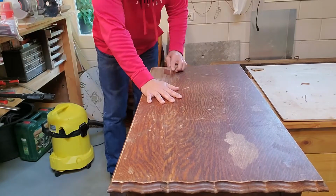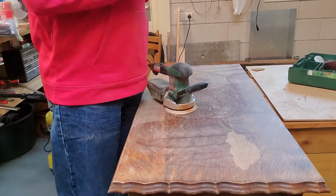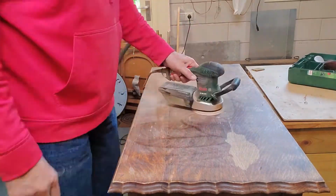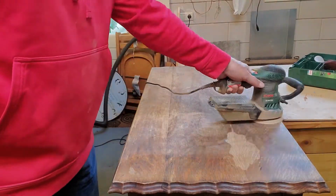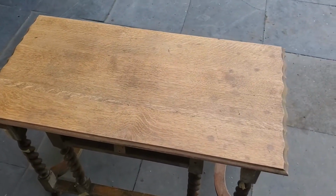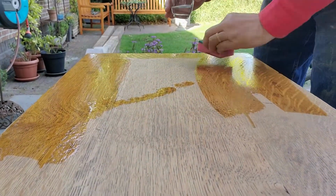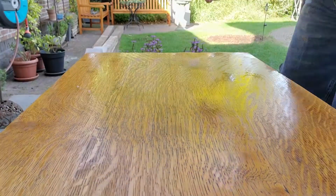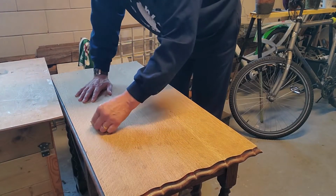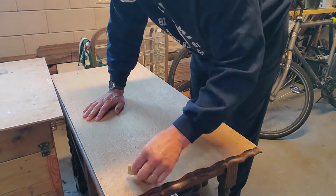The top was really bad, and it's going to need some oxalic acid on it, but I was going to sand it by hand, and that was just a bridge too far. And you can see here the discoloring, so we get the oxalic acid out. Did this about 3 times. It helped. Not everything went away. And here with 220, just lightly over the top.